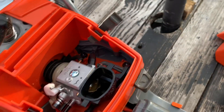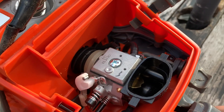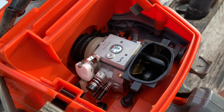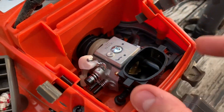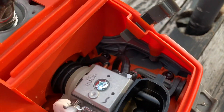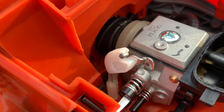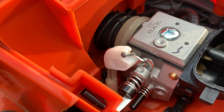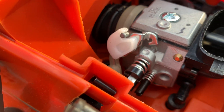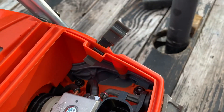You might think, what's the big deal if it's not stable while running? What happens is it messes with things when you start tuning. Just that little vibration, and also think about when the saw is on and you rev it up while tuning with the cover off — see what happens there? I'm just barely pushing on it, and you can see how that throttle linkage is going up. So that messes with your tune, making it really hard to tune accurately.